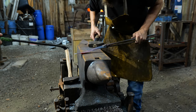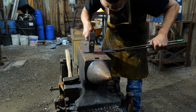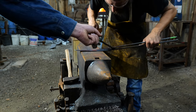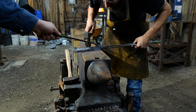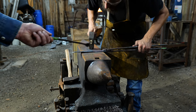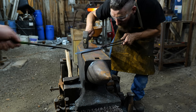Now iron it out and straighten it. Lay it dome-side up, give it a light tap and get it straightened in line. Flip it over — see how there's a crease running that way? Smack it. You just want to get this straightened. Hit this edge because there's a little twist in it. We'll get it hot again and work that one more time.